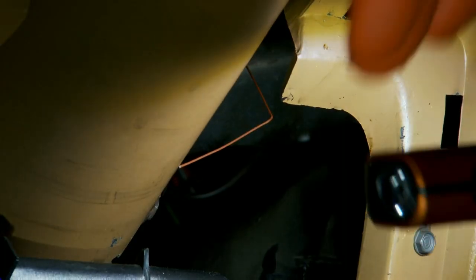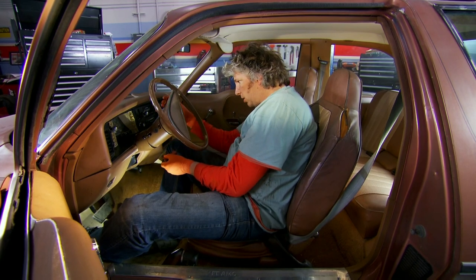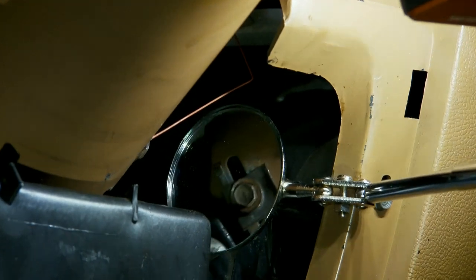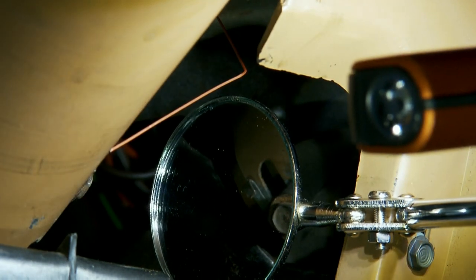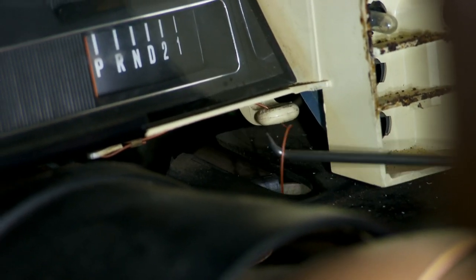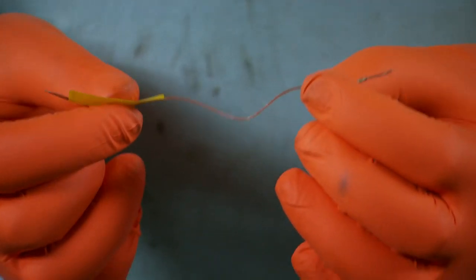It's not easy to see what's going on, but I can see a kind of cable or wire. I'll try and pull that — and straight away we've got our display going backwards and forwards. Clearly there's some kind of break. This is obviously going to be attached ordinarily to our column here. There's like a hook screwed to the column with a sort of adjuster, but also the wire has got a kink in it — I reckon that's where it's doubled back on itself around the hook. The original cable has a loop at each end and it seems at one end the crimp has given way.